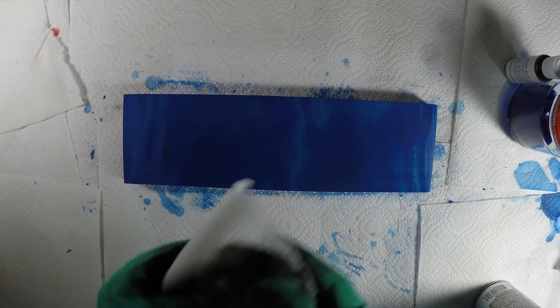This is dried out pretty well now. I'm just taking a dry cloth — there's nothing on it — and just burnishing it up to help even out the dyes. It can also help deepen and darken the color a little bit, and it just preps the surface for the top coat sealer. I just want to make sure there's no debris or fuzz afterward. So this side is the second application, this side is with the dye concentrate drop applied, and this piece here is with the dye concentrate drop applied to the dye-saturated cloth.